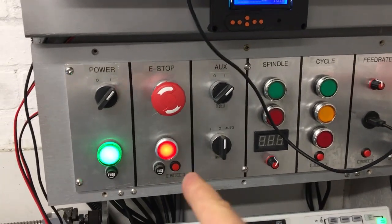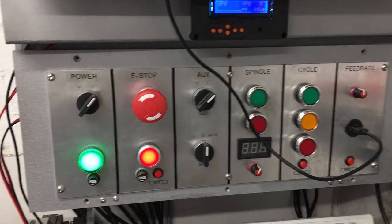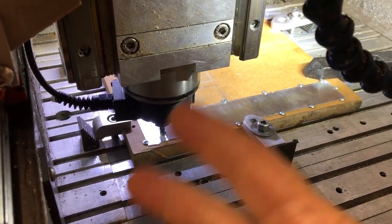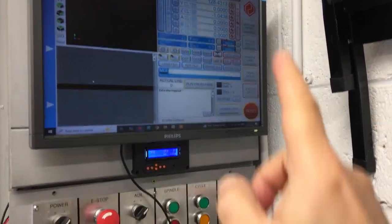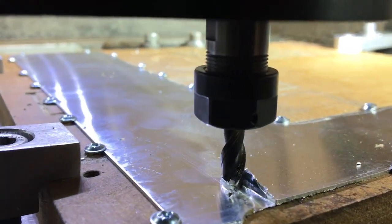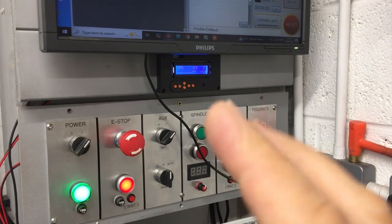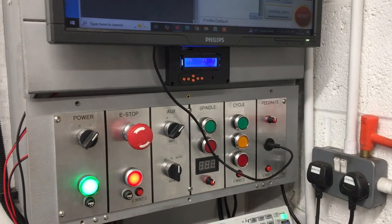Well, it's a bit nerve-racking, but it worked. Maybe it could come in a little bit quicker, but we didn't break the end mill and it did actually stop. As you can see, the whole thing's tripped out - the machine, the software and the spindle as well. So it did actually work. For just a split second there I thought it was going to break it, but it did actually stop in time. On the software I probably need a little bit more tuning just so it goes a little bit quicker, but it's actually working.